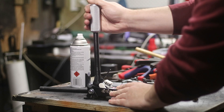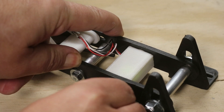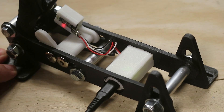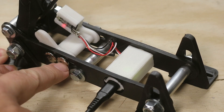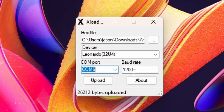Next we just plug it into our PC and check it's working. The sensor lights up with a red light, and as I move the handbrake back it should dim — if it doesn't, your magnet might be around the wrong way. To adjust sensitivity, just move the block back and forward. Once it's all done we need to program it. Set the baud rate to 1200 on your XLoader, set your hardware and firmware, click upload, your computer will make a noise, an extra port will appear — choose that port and click upload to upload the firmware. Now we're up and running.